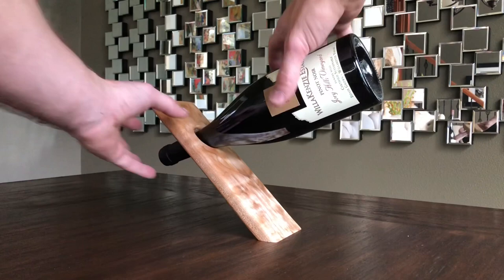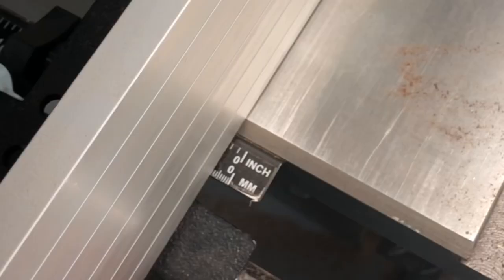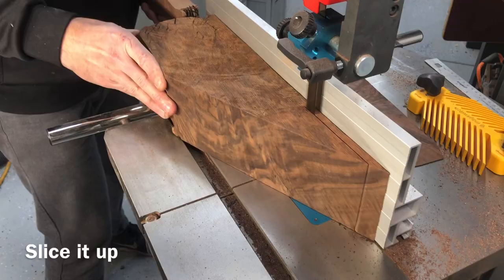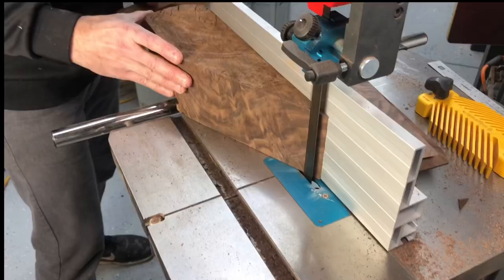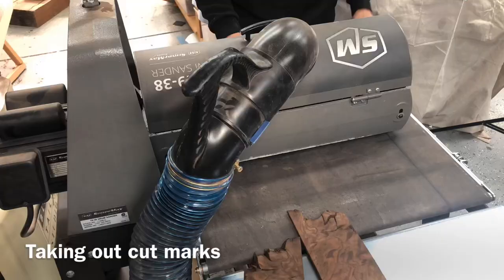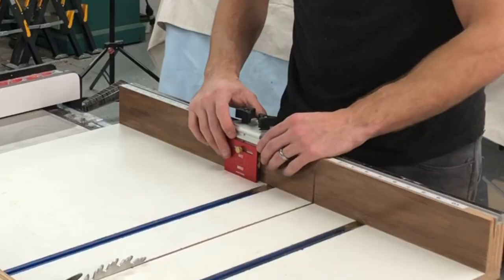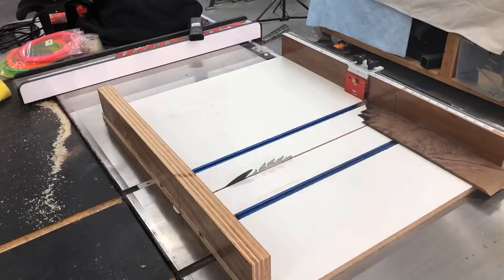The next project we're going to do is also drink related, and that's going to be making some really cool wood coasters from this beautiful black walnut burl. I have made a lot of these coasters in the past, and I actually sell them around Christmas and Mother's Day. I even made a full YouTube video just on making these coasters, so if I rush a little bit too much here, feel free to click the link in the video description. Basically, we're just going to rip some 8mm strips, keep them as long as we can, flattening with the drum sander, sanding them all the way up to 180 grit before cutting them down on our crosscut sled. 4 inches by 4 inches is about perfect — these were just under, about 3 and 7 eighths, and that will still be fine.